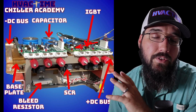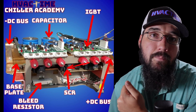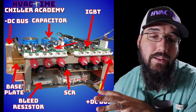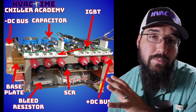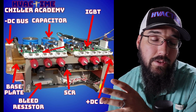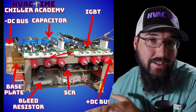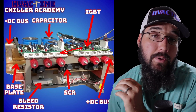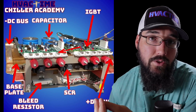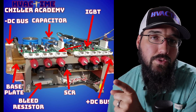There are other things involved in the process as well — boards and modules that are also in the circuit. We have something like a trigger board, which controls the gates inside the SCR. We also have a logic board that plays a part in controlling how these components function together. This IGBT is technically a three-module IGBT combined into one; each section between these posts is an individual IGBT gate assembly. The logic board helps synchronize all these things. Depending on your drive, the trigger board and logic board can be combined into one primary module.